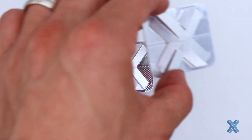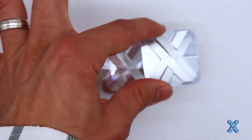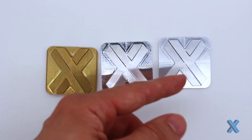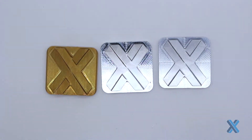If you are going for RoHS compliance, take a look at the clear coat. Note that these exact same parts with the clear coat have a little bit more of a matte or clouded finish compared to as-milled, because there is a coating there. If you have any questions on iridite chem film conversion finishes or other metal finishes, let me know — I'm happy to make a video on it. Thanks so much.